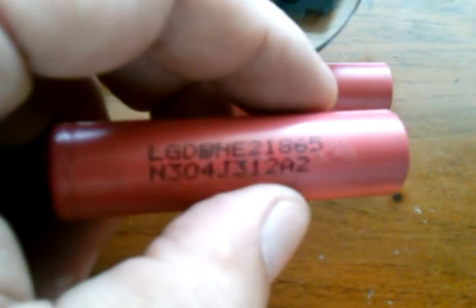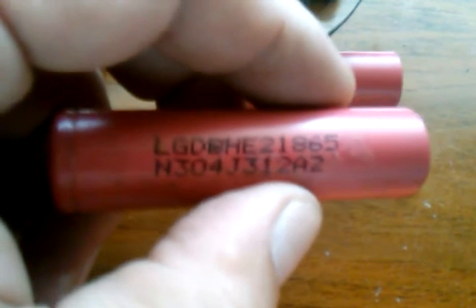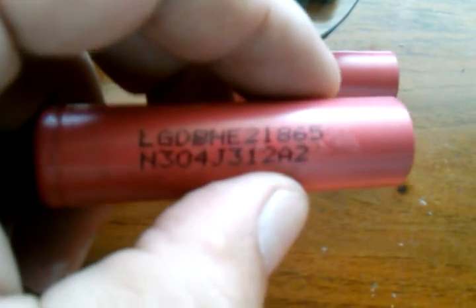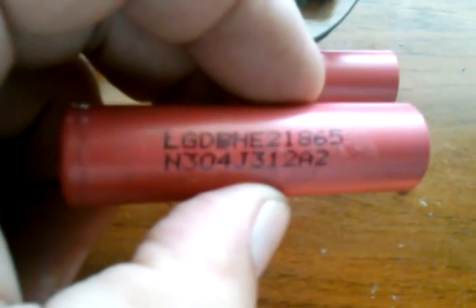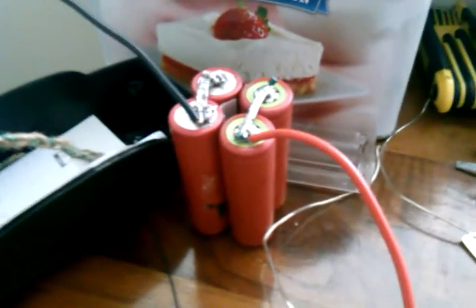Which is different than the other types of batteries — I'll have to give a better explanation video. But the ICR's have a high discharge rate, and these are 35 Amp. The laptop batteries that I pull out of my laptop to do experiments on, these are all lithium ion, not LiPos. They're double density, higher energy capacity.